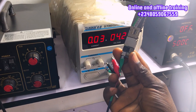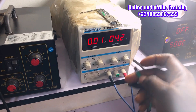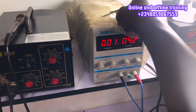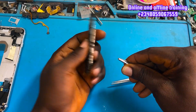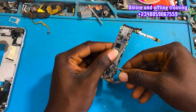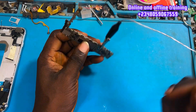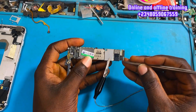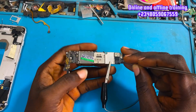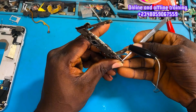You can see there is an auto amp reading — that means current is being drawn from the PCB. There is a component that is shorting on this PCB — that is a full short. The next thing is to use our alligator probes: black probe to ground and red probe to the V-BAT line.